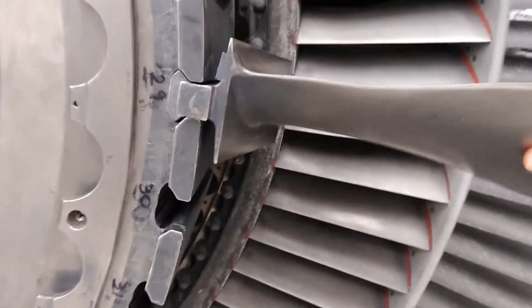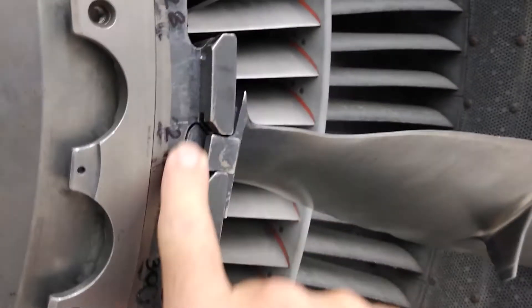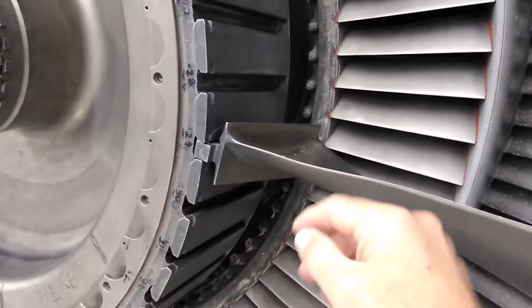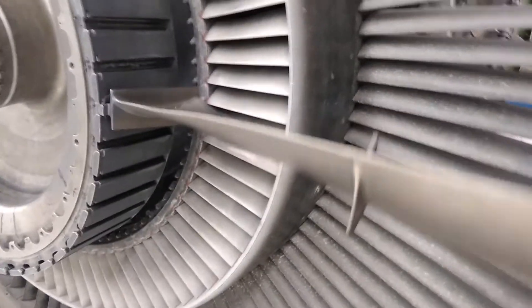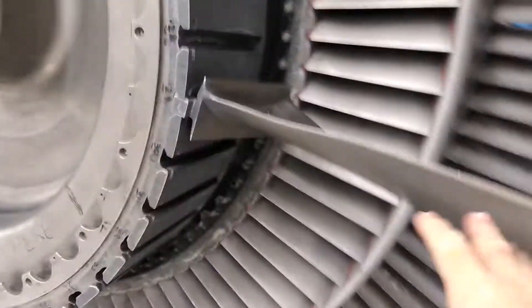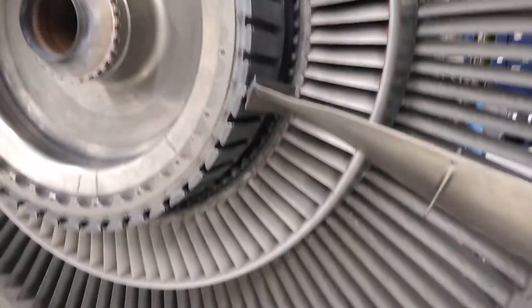So there's room to move. Now when you slide it all the way in, when the blades are installed, there's a locking ring that goes on the inside here into that notch, which prevents — it locks the blades in place and prevents them from sliding out towards the front of the engine. But it does not lock this side-to-side movement. Look how much room there is for that blade to move. And that's done on purpose to decrease vibration and make up for differences in temperature and different operating conditions.